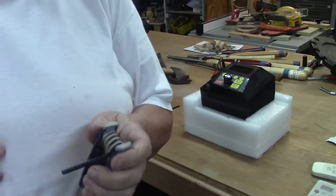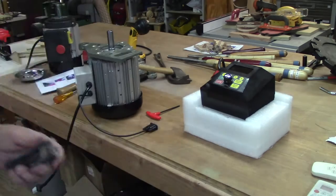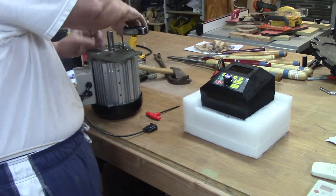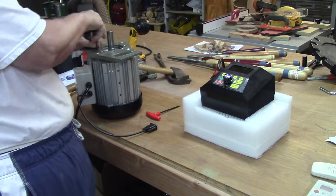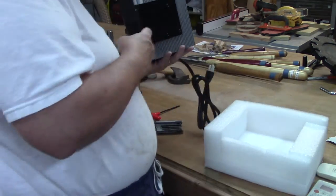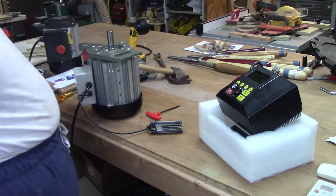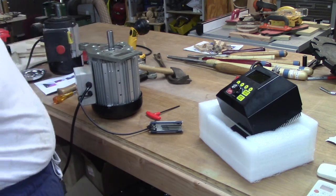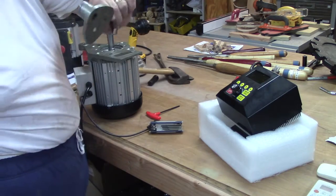The other point here is that when you're going to put the faceplate on and take the faceplate off, do yourself a favor, get the right angle Allen head screwdriver so that you can get the torque on the short end of that and put it together and position it. Just go slowly before you put the pulley back on. Once you put the pulley back on, you don't want to do that again.